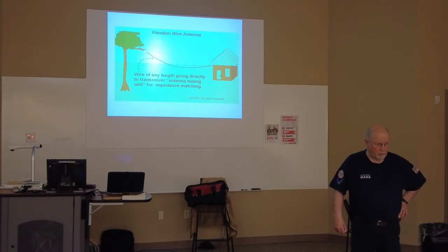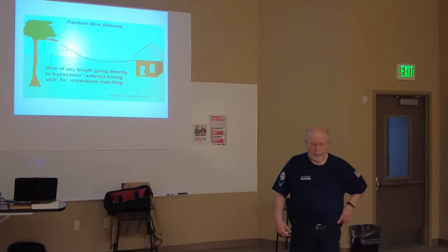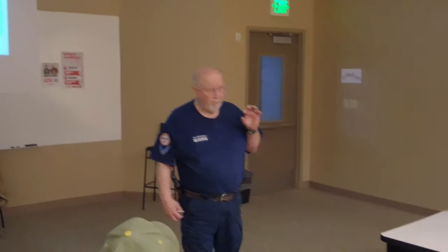In 1996, I got sent to Atlanta to work the Olympics. And they put me up in a multi-story hotel, and I wanted to work my radio. So I went to Radio Shack and bought that little spool of hookup wire. It's 30 gauge. So it's not much bigger than human hair. Went to the hardware store and bought me a 10-inch, 1/8-inch bit, and I drilled me a hole through the aluminum window frame. Wrapped me some solder around the end of that 30 gauge, fed it through the hole, and let it drop over the windowsill, and hooked it up to my radio, and that's how I operated HF in Atlanta.